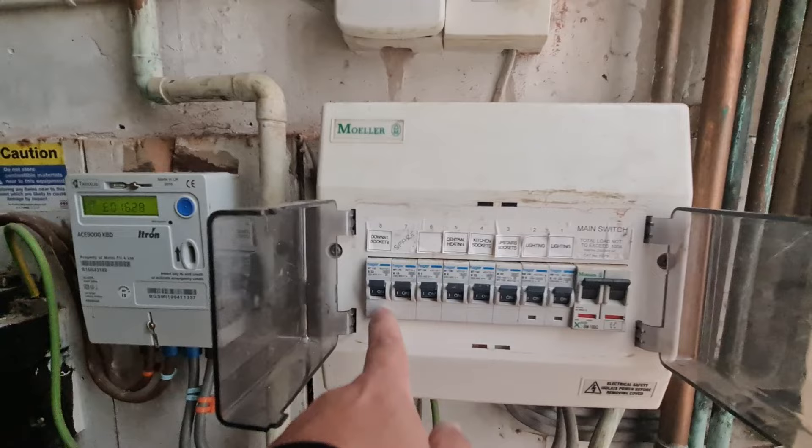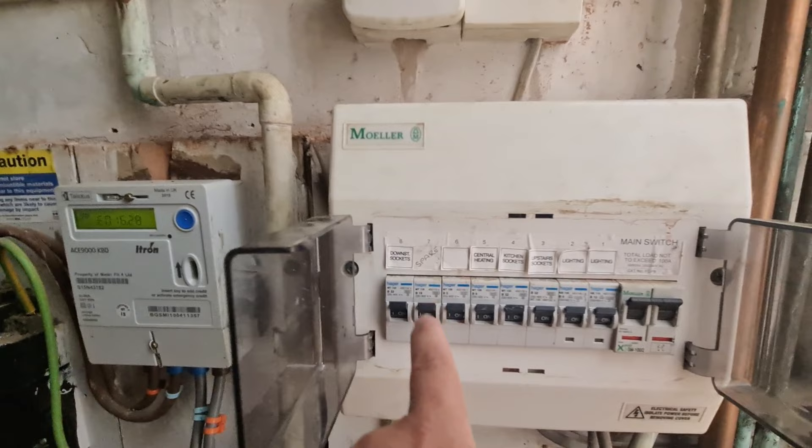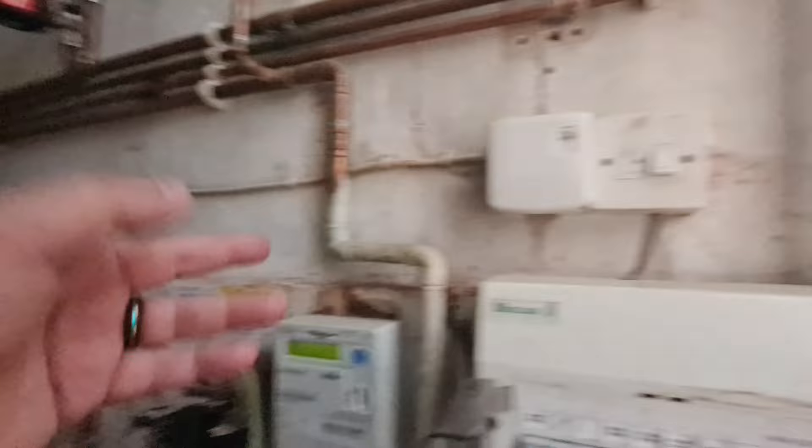There is good division there among the circuits - sockets in the front room and dining room, perhaps that back office space. Spare way - we'll see if they are when we get the lid off. Central heating going off to this boiler running through this spare here. I would imagine that was fitted at a time it would have needed RCD protection. Most of these Ideal boilers do say in the instructions they need 30mA RCD protection - that's kind of been ignored by the installer.